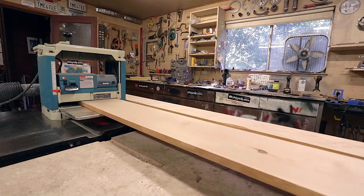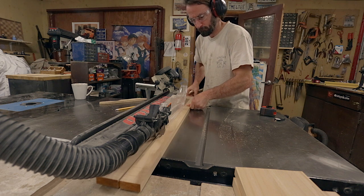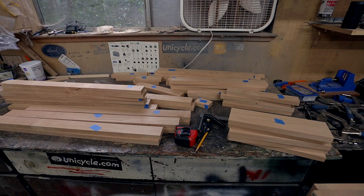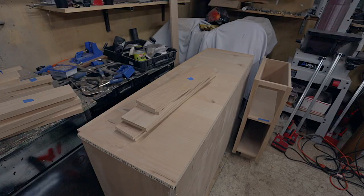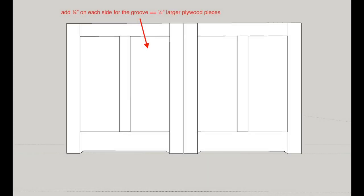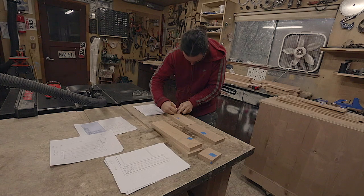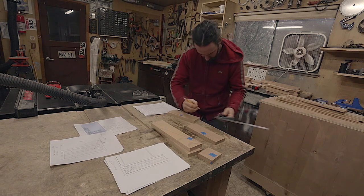After I make up the cut list, I plane the boards to 3/4 of an inch thick, then rough cut the wood to length, rip them to final width, and finally cross cut them to final size. I check off pieces on my cut list as I make them, and finally I get a stockpile of everything I need. I also cut the plywood for the doors — I'm using A-grade 1/2 inch alder ply. The plywood has to be 1/2 inch larger than shown on the model in order for it to sit in a 1/4 inch groove. The first thing I do is cut out the accent in the bottom of the doors — I detailed this in episode 4, so check the link in the description.